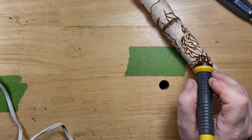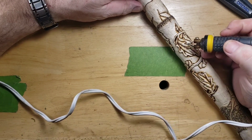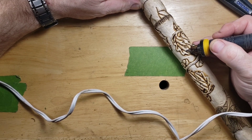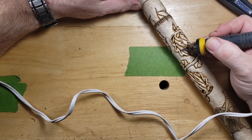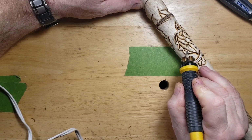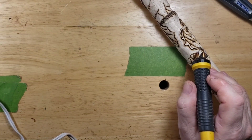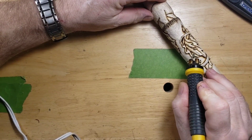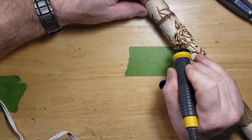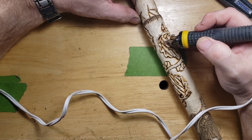Bump it up a little bit until I get a reading here. Okay, 18. Now 18 is running pretty cold, right? But you can see I can still make it tan. See that, you guys? And of course, the hotter you make it, like this here, the darker it'll make the leaf. So you could use it for putting colors on your leaves too. Okay, that's 26. That's a better example. So you could use it to shade your leaves, and you wouldn't even have to use stain or anything. Kind of like that.